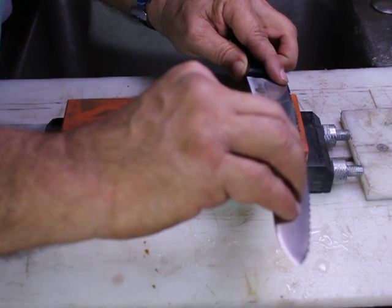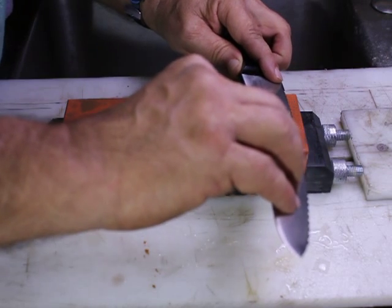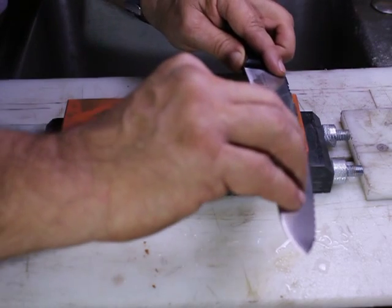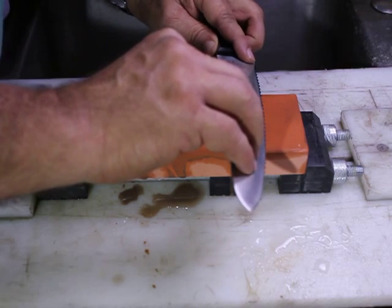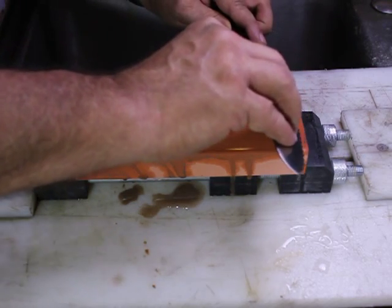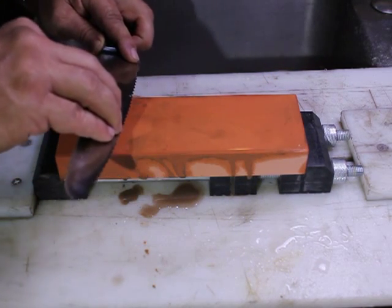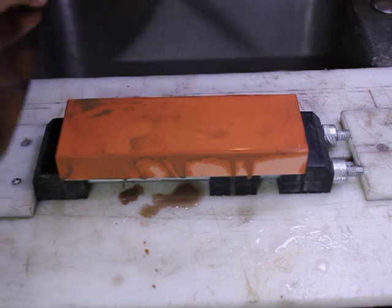And because it's a wavy serration without a single point along the top, this edge follows the curve very nicely for the individual serrations. And it doesn't particularly harm the stone, so you can follow it a bit more deeply like this. But you're maintaining a constant angle. And again. All right.